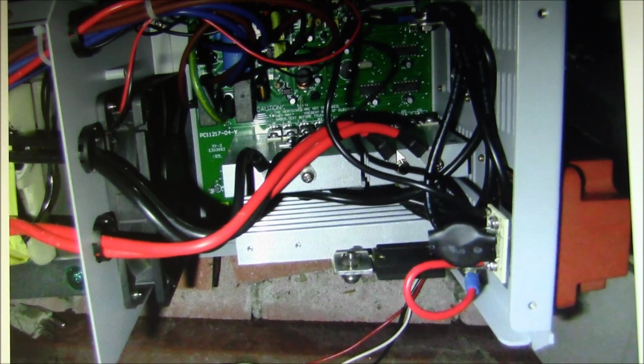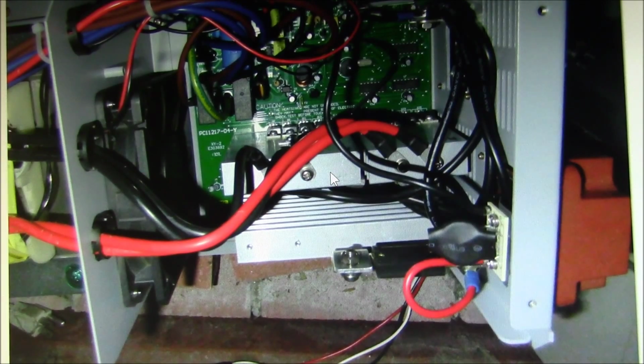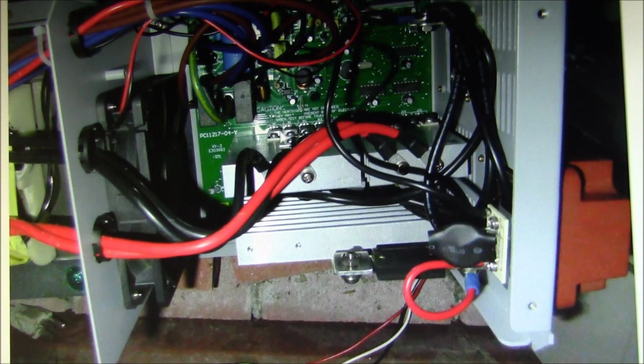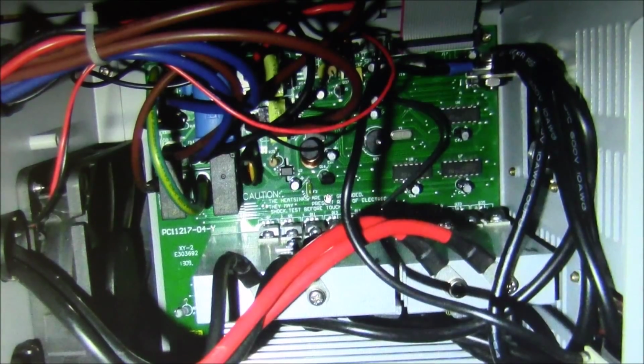This is the red wires that come off the transformer and the black wires. The positive from the battery is attached over to this heat sink. So the heat sinks in this unit are live. If you look at the 200 amp fuse down here and 5 MOSFETs in parallel, that's about 40 amps per MOSFET. So if we go up here, let's look in this upper left-hand corner.